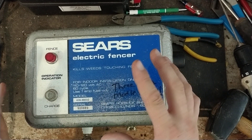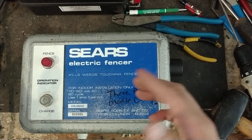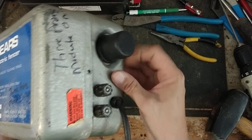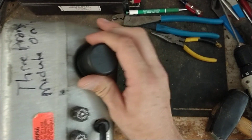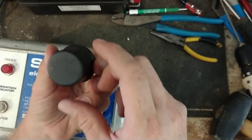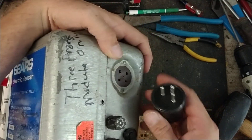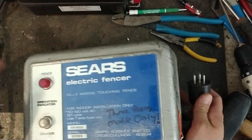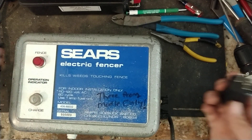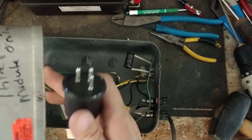It uses the same kind of casing as the old metal Parmac units — even the same kind of rivets. It's similar in the idea to how the old Hold'em model 57s were built, but Hold'em was their own brand and Parmac was their own brand. This has an old three-prong circuit breaker on it. I did try a new one first and it didn't seem to work right — it was coming on and powering up, but that red light bulb wasn't working. I thought it was just the bulb, but the bulb was fine. So it ended up being something feeding the bulb that was the issue.